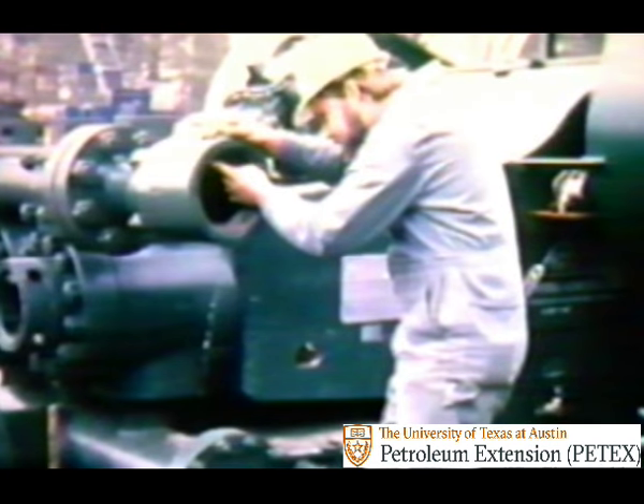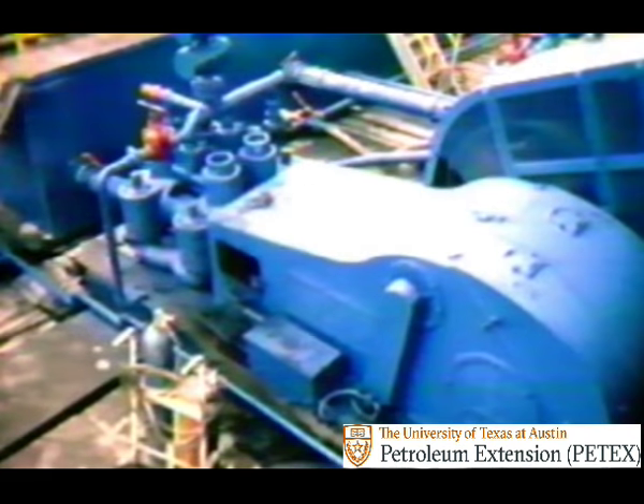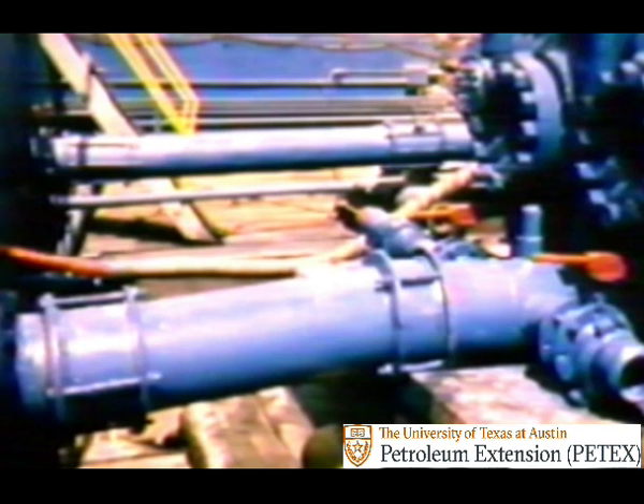And that's you. You're the troubleshooter on the team. Unless you can spot what's wrong and know what to do about it, the whole system can foul up. For example, we were talking about friction and about the mud running out of pressure and coming back to the pump to be recharged. You can make it easy for the pump to recharge the mud or you can make it harder—just by the way you hook up the suction lines leading to the pump.